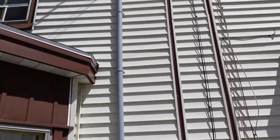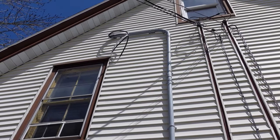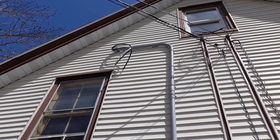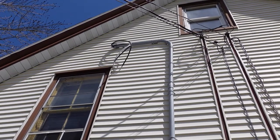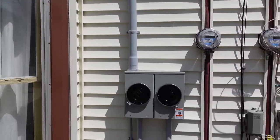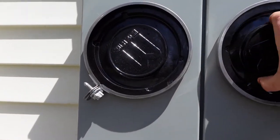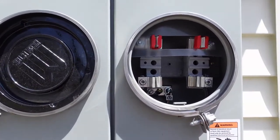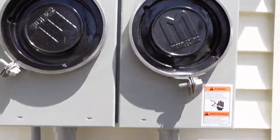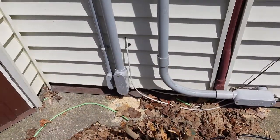It's worth a note that the main service size conduit is 200 amp, and as you can see we've kicked the top of the service over to get our one meter off the window, which is code here. The service size conductors are 250 kcm — or MCM in the US — and the pipe is two inch. This is coming into a 200 amp, 100 amp per position meter base. Inside is where the meter goes, and then we come out of the bottom and go with our inch and a quarter pipes into each panel.